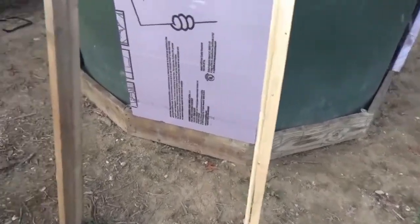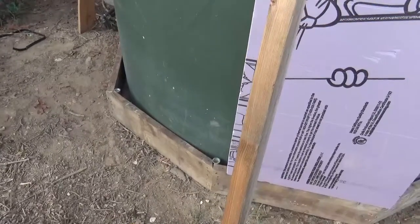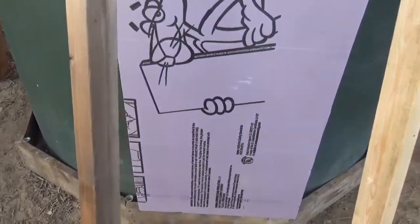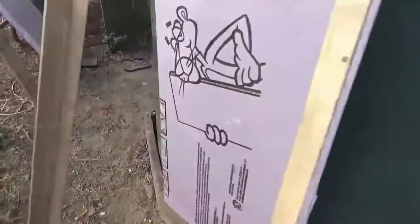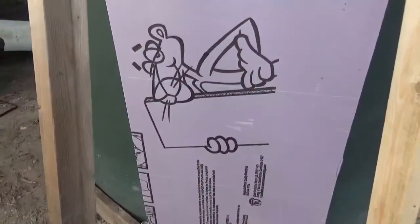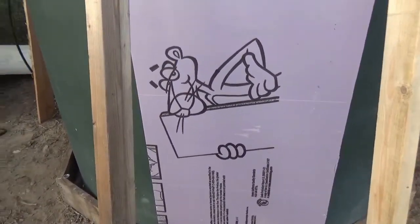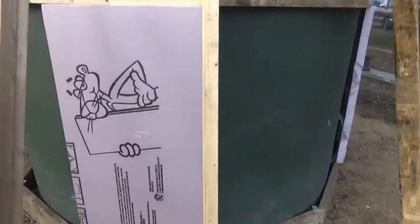Where I use a straight piece, I used a 36-degree angle, but you can also use two 18s and butt those together — it just depends. I'm going to wrap it with this two and a quarter inch material. It has an 18-degree bevel on it, cut on the table saw. You got to be careful — it's a little tricky because it likes to bounce around, the blade likes to grab it. Maybe a skill saw might be the way to go, but I'm going to still use the table saw. Just got to be careful.